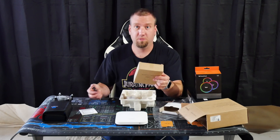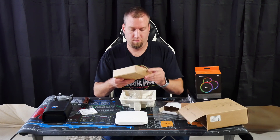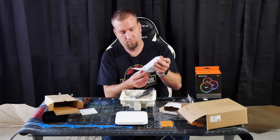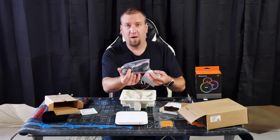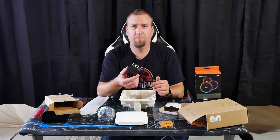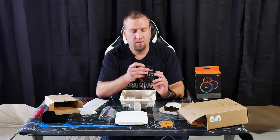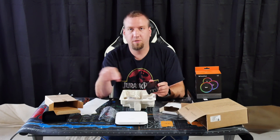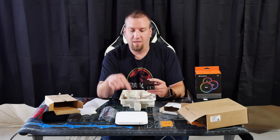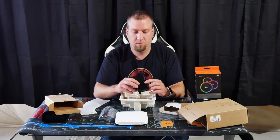Now let's see what comes with the PoE adapter. I suspect this part is going to be really boring, but let's see if I'm right. The power cable fell out of it, and then here's the PoE adapter. In case you don't know what this is: you plug the power cord into a regular power outlet, and then one of these ports goes into your switch, and then it plugs into the AP. That provides power to the AP and allows it to run, but it also carries the data signal — like your internet — to the access point. Pretty simple, straightforward.